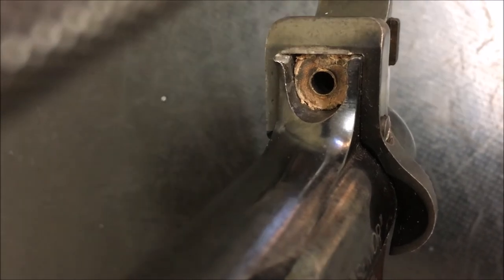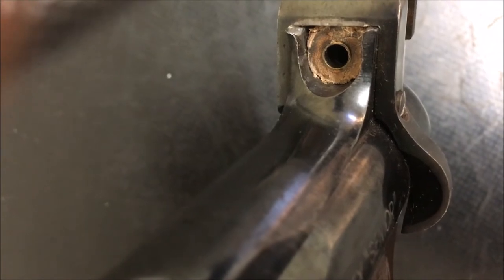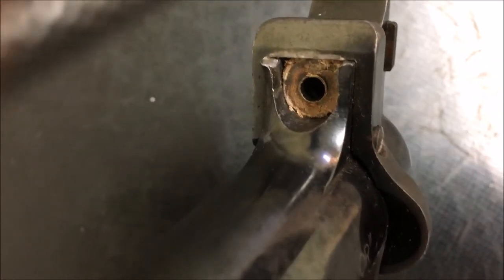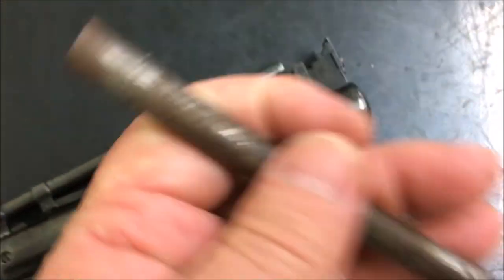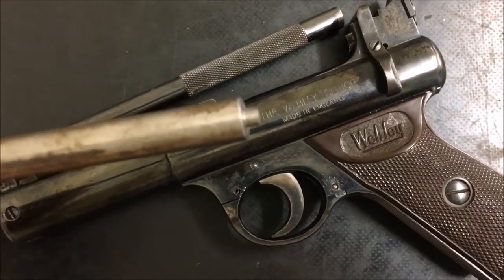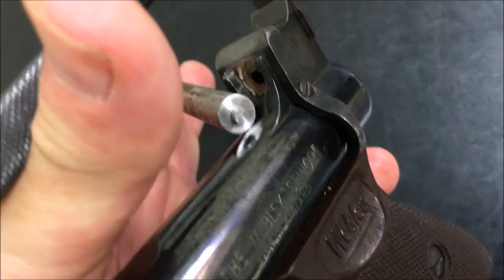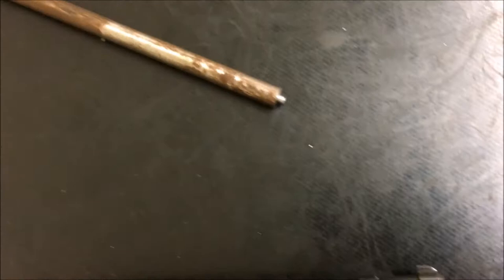You need to be able to tap the seal in while supporting the brass insert so it doesn't get knocked out of shape, and also support the leather so it doesn't crack. I couldn't find a picture of the original Webley tool, but I worked it out and got on my lathe. I took a bit of 10mm rod and machined a small protrusion on the end — exactly the right size to slip inside the little brass insert, acting as a supporting punch.